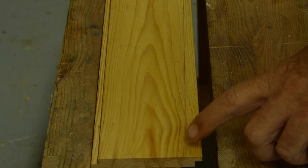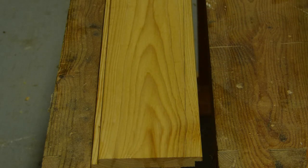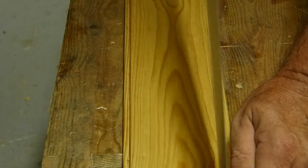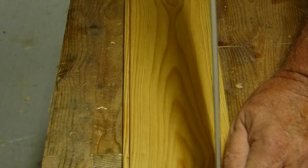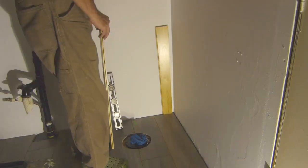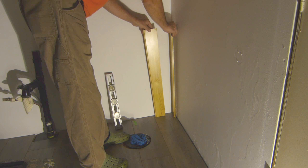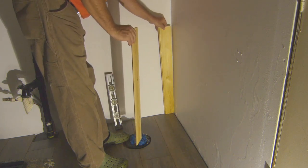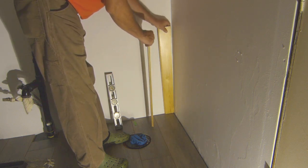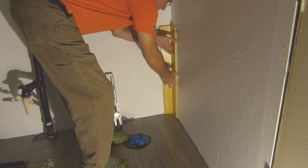So, my first piece — that's how far out of level the wall is. So I'm going to have to rip a bit off of it. This is the normal view of the corner, so you have two choices: you can put that one in first, or you can put this one in first. But if you're looking the way you're looking now, you want to put this one in and then that one — and that will make a better hide.